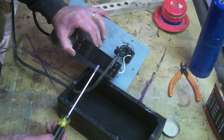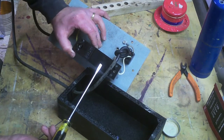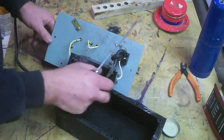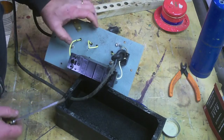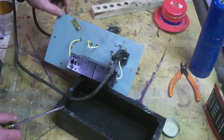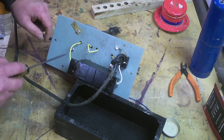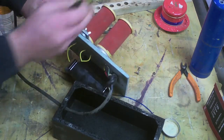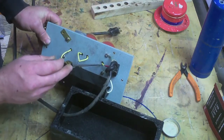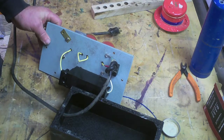We've got coming out of this a Heinemann Electric, Trenton, New Jersey, made in USA, case number 1-1110, patent pending. So that's our breaker. The wire is tiny — it's maybe 14 solid wire. We've got a ground tab right here which went to this box, but it appears to go up this coil, down, up this coil, back out the other side, to the switch. And of course, one side of power comes through the breaker.